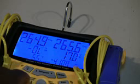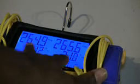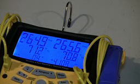This is pretty much the home screen. We've got your superheat and subcooling. The next screen shows you your line temps, which you're measuring with these two clamps. Dialing in the temp probes on the clamps is pretty easy. Once you plug them in, you have this potentiometer right here. According to the instructions, you drop them in a cup of ice water and set it for 32 degrees. I just set the clamps in any water temperature, use a couple of thermometer probes to get an average of where my temperature should be, and that's where I set the clamps.